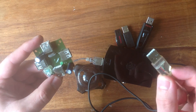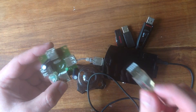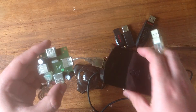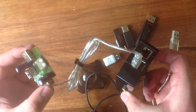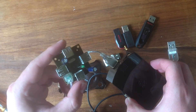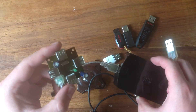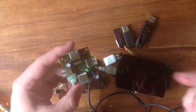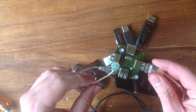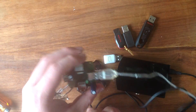I'm not too sure what would happen, but I'm not willing to test it. Some people seem to think it would mess stuff up. I just think it probably wouldn't mess stuff up if you accidentally powered the Raspberry Pi from this side. However, you would lose over-current protection, and if something were to fail on this cheap piece of rubbish, stuff might burn out and you'd be left minus something. What this does is it powers the hub through one of the unused USB ports, so now you have quite a bit of added capacitance on the power supply side.